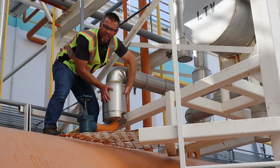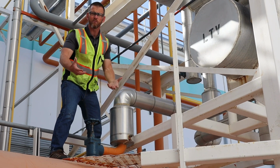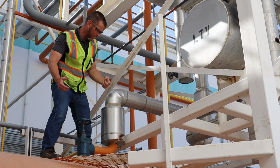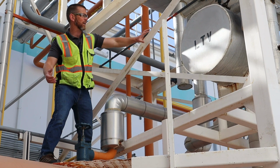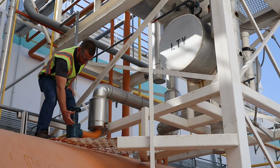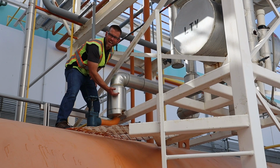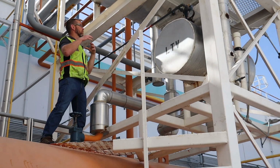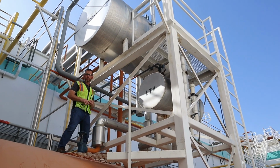Once again, this kind of a larger insulated piece of pipe has a check valve under it. And that's another very important check valve. It only allows flow into the vessel. Under normal conditions, when the transfer vessel's connected to the low side of the system, high pressure vapor isn't allowed to flow backwards because this check valve prevents that. So that provides you with a really good overview of how a gravity transfer system works.